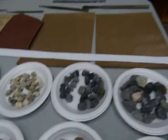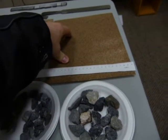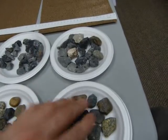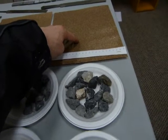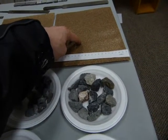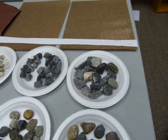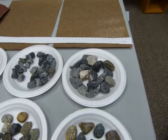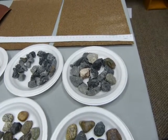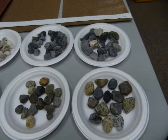A smart way to work is: when you start sanding, you'll notice that for a certain amount of time — depending on the hardness of the material you are sanding — in softwood, sandpaper is going to last longer before the particles wear down and dull. But there comes a point, whether you are sanding hardwood, softwood, low carbon steel, or something very hard, that you notice it does not remove material nearly as effectively as when it was fresh. Change your sandpaper — because your wages cost a lot and sandpaper doesn't. Your employer expects you to notice and change sandpaper accordingly every so often.